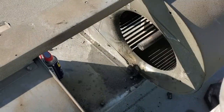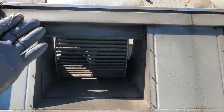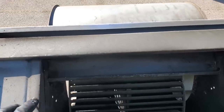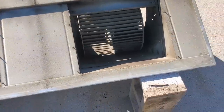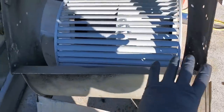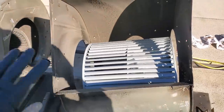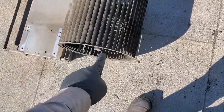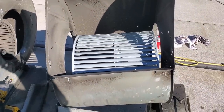Keep this together so we know how to assemble it. Hopefully we can get this out now. Now that we got the blower wheels free, we're going to pull them out this way. We've got to get these little brackets off — there's usually a couple screws. We'll take those off, then pull the blower wheels out, and work on getting the keyways out of them. We flipped the housing over and we're doing them one at a time so we don't get confused. We're going to put the bracket back, flip it over, and mount it back. We've still got to get the key out of the old blower wheel.